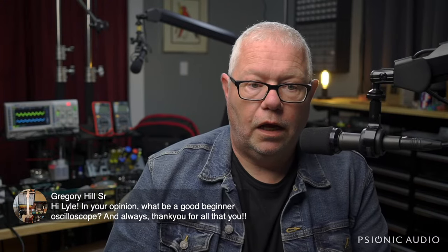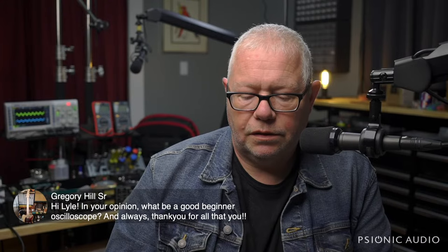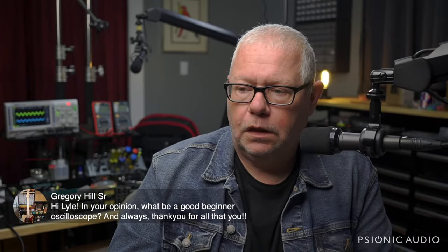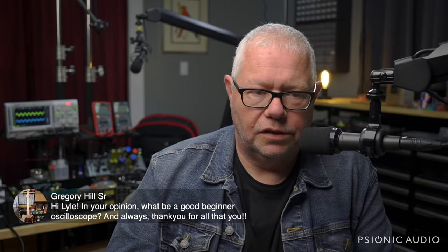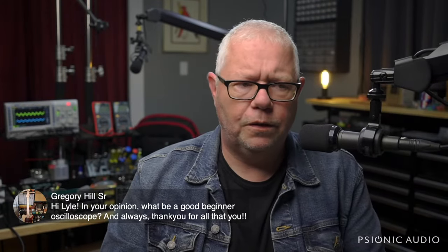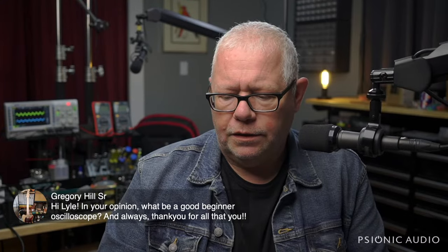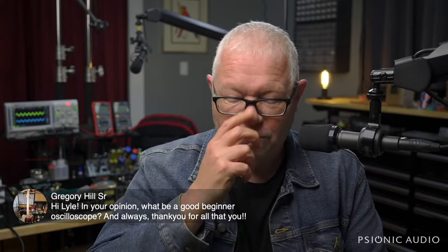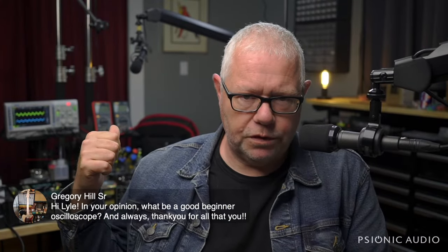Hey, Gregory Hill Sr. What would be a good beginner oscilloscope? Well, it's tricky because in theory you should be able to go to ham fests or estate sales, et cetera, and maybe find some old analog thing, but you have to already know how to use a scope fairly well to tell if it's working. And it's hard to fix the scope without a scope. In general, I would say probably the Rigol digital scopes are the way to go.